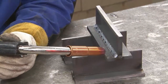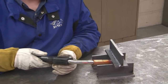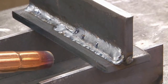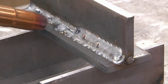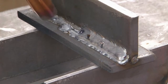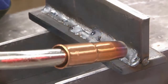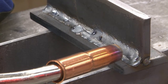By tilting our gun down slightly, we achieved two things with this horizontal fillet weld: we have a fillet weld with equal legs — the same amount of weld on the base plate as on the top plate — and we prevented undercut along the top plate. I made two more passes on this fillet weld on the T-joint in the horizontal position. The second pass runs between the first pass and the base plate, with the crater running right in line with the toe of the first pass, and my gun angle tilted up for good penetration into the base plate. The third pass tied the second pass into the top plate, angling the gun down again to support the liquid pool and prevent undercutting the top plate.